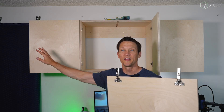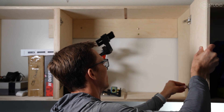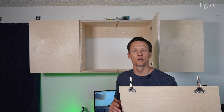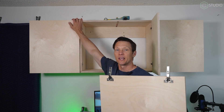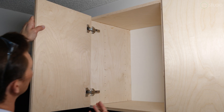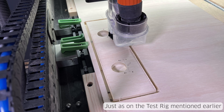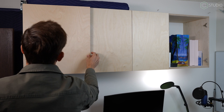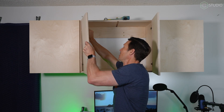When it came to the doors, I had two separate issues — one on the ends and one in the middle. In the middle, like an idiot, I didn't measure properly. The first time I hung the doors, I had my hinge positions correct and my clip positions correct, but my doors were too wide. So I recut the doors, and I'll use those panels again later to make something else. On the outer two doors, my problem was that I had not laid my art out properly from the top edge of the door relative to the clips and hinges. The very first time I went to put on the outer door, I put on the top hinge and the bottom hinge didn't fit. My solution was to make small strips to test that problem in much less wood, then re-measure to make sure the door width was proper — and when I brought those doors in, they went on perfectly.